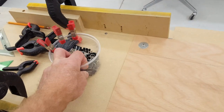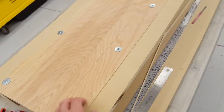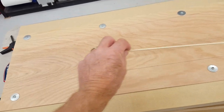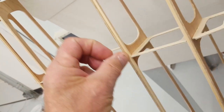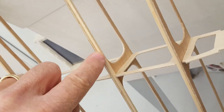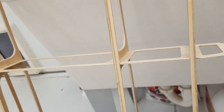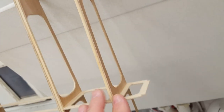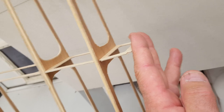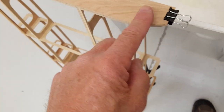Go buy some binder clips — I'll have probably 75 of these things on here at any given time when I'm mounting all of those rails along all of my center section pieces. These eighth-inch stringers run the length of the center and they have an eighth-inch piece reinforcing them, so it gives me a quarter-inch worth of width for good gluing and strength. I've done the same out here — these are sixteenth-inch — and then the non-trip will actually be outside of it. You can kind of see the configuration of the non-trip looking at the transom here.